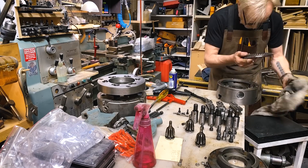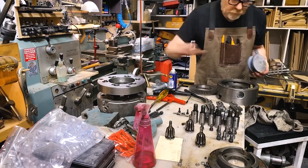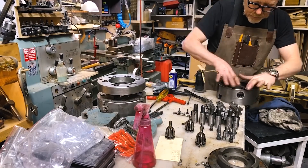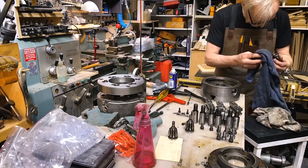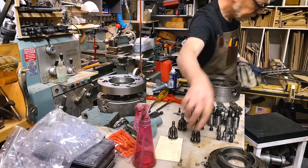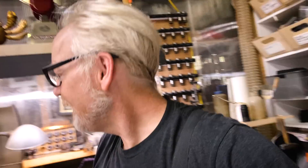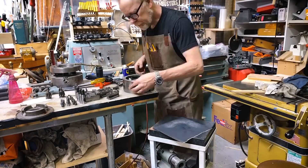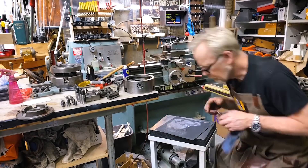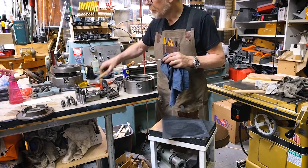You can actually see me here adding some grease and then removing it — I pull out my grease gun, add some grease, and then immediately start scraping it away. I thought maybe I should just grease it because I couldn't get the three side pins out, but then I figured out how to get them out and realized I should clean out every last bit of grease in case there's any dirt or grit in there, then put in some new grease, reassemble it, and add a nice coat of machine oil. Before putting it back together I ran each part with some 400-grit sandpaper just to clean it up, went down to the bottom of every single hole and wire-brushed everything out. Just cleaning out the naked body of the chuck shell with a rag felt really good.